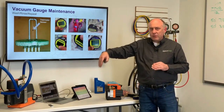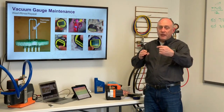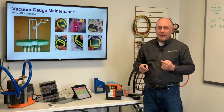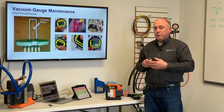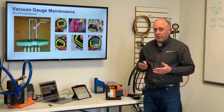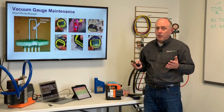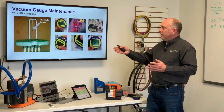When I start it back up again, I want it to suck right back into the compressor. The cool thing is when that gas works its way around, I'm not going to carry the oil all the way over to the micron gauge. So all I'm going to expose my micron gauge to is a small amount of refrigerant. Refrigerant will make the gauge read a little funny, but it will not contaminate it with oil. Oil is what contaminates the sensor — refrigerant won't hurt the gauge.